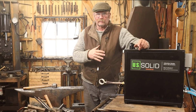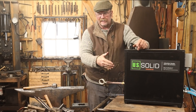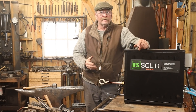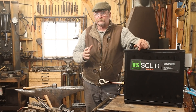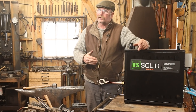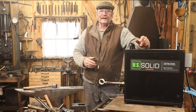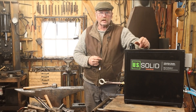There are a lot of very similar ones out there. I think they're probably all the same — they just have different branding on the outside, but they all look identical otherwise. This particular unit runs on 220 volts and draws just under 30 amps, so it's something within the reach of most small blacksmith shops. You can get bigger units running off of three-phase 440, but I don't have that and I don't think I ever will.